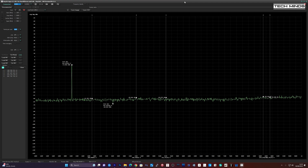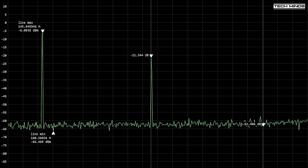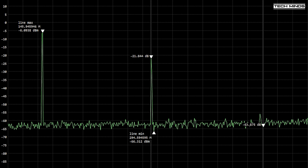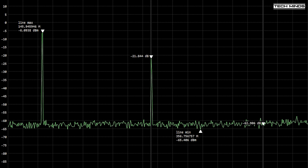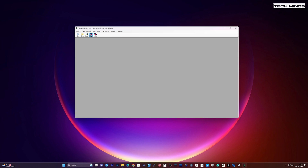The reading we saw when transmitting at 145 MHz is actually quite bad. 15dB down on the fundamental means you'd be clearly heard on any radio in the vicinity on that second harmonic frequency. So in my opinion this radio would not really be usable on the 2m band, which is quite unfortunate as this radio does have a real chunky, good feel to it.